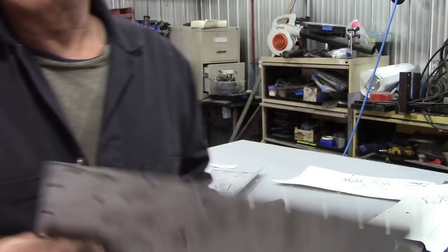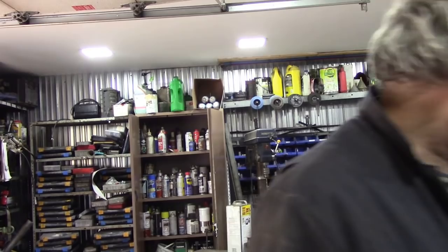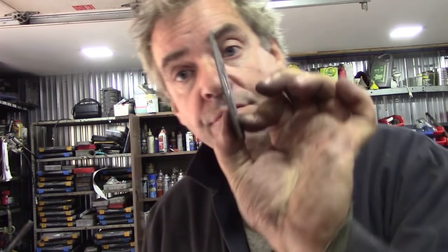So the next thing is to cut out the footwells. Now, you could do it with a grinder, a slitting disc, you know, like one of those. You know those really thin ones? That would work well. In fact, it would work actually better than the plasma. And in fact, that's what I might just do. Get your goggles on and cut that old panel out.